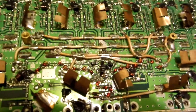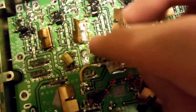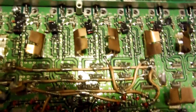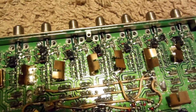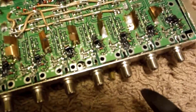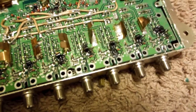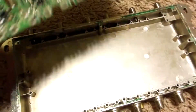There's just one bolt there and one there. After removing both bolts, our next step will be to go to each and every one of these ports and physically break the connection between the pins for the coax connector, and be able to free the board that way. You simply use your ordinary side cutters to do the task. After pulling with the side cutters to remove all the pins, there are two of them in each of these holes — I was able to pull out and up to free the board.